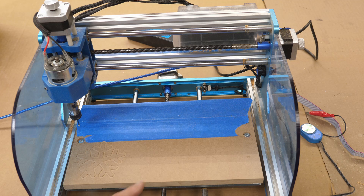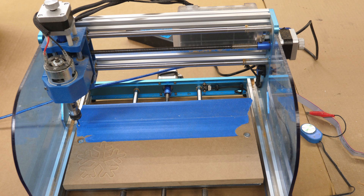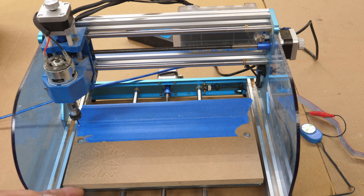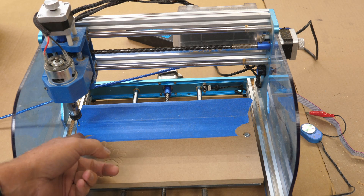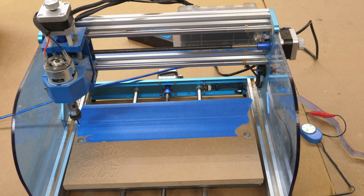So how did I make this? This is just plain old half-inch MDF — you can get it at the home center, wherever. I like to use MDF because it is flat. There are methods to actually surface a spoil board if you want to get into the nitty gritty, but for those just starting out, just stock MDF. Make sure it's not been laying somewhere and got bent, warped, or cupped. I measured and laid out two holes using the center mounting hole on each side. This bed on the ProVer version 2 does not have T-slots, it's just a flat bed with threaded holes. I grabbed a couple of screws from my junk drawer and countersunk them below the surface so the bit won't hit them accidentally. Then I put blue tape on there, and I'll get into the reason for that next.